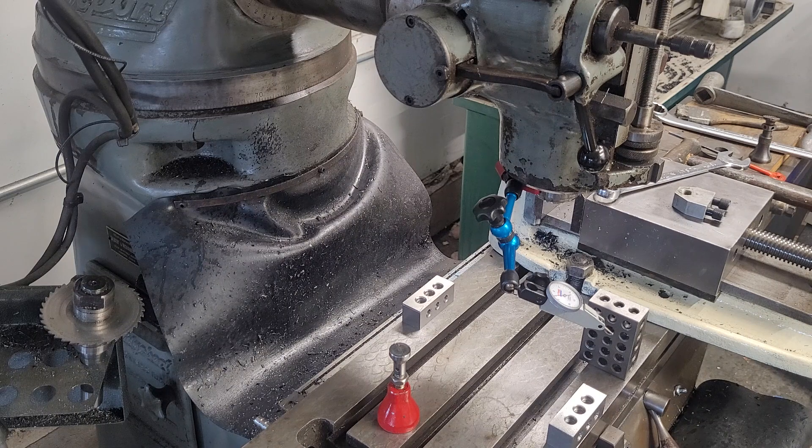The big source of error on this machine is the vice. This isn't something I've checked because there's no adjustment, so I don't check it regularly unless I move the head around. Since I haven't moved the head in quite a while, I haven't checked it since then. But let this be a lesson to you: check your machines. Don't count on it — even though there's technically no adjustment, things can still wiggle and settle. Thanks for watching guys, I hope you learned something with me today.